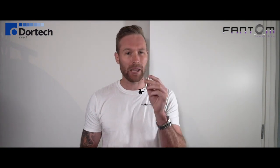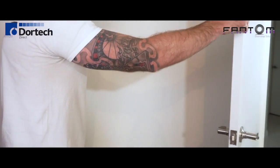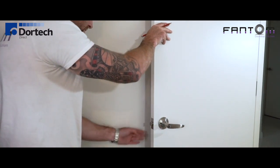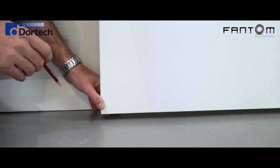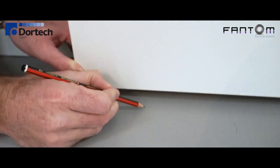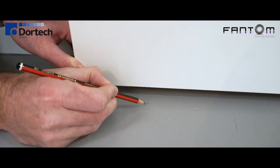The first thing you need to do is mark the pin location on the floor. Open the door up to its desired stopping location, allowing some clearance for door flex so as not to damage the wall. Lightly mark the floor along the door edge where you wish to locate the floor sleeve. Make a cross to accurately mark the center of the hole to be drilled.